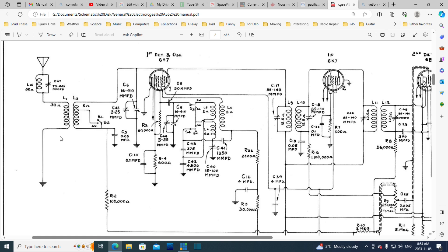Now we'll look at the actual schematic. This is the coil we're dealing with here. There's a trimmer up here, which is kind of interesting. But where's the capacitor? There's nothing in here. It's possible that's the capacitor, but its connection did not appear to be the ground. There's a ground right here that would be right up. So you could run this capacitor from here to here — and it would look just like it does in the radio, running at the bottom of the coil. This is probably it. The capacitor is sufficiently big to be a .05 I think.